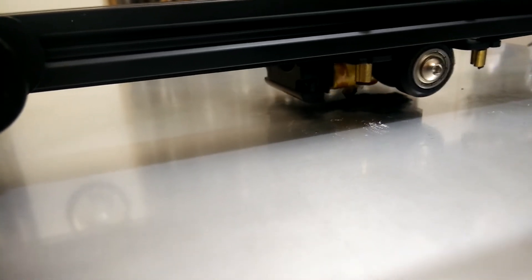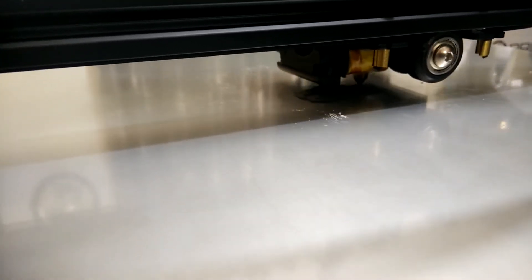It's been a few hours since my last clip and I'm still pretty impressed with the output from this machine. I've got a MechWarrior Online Warhammer in progress. One thing I've noticed is this roller here does look like it's got a little bit of scarring, so I might need to adjust the nut on that one. I also need to double-check the belt tension — I wonder if they're a little bit too tight. But overall quality still seems pretty good, currently printing at 0.1 layer height.